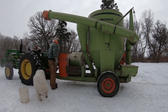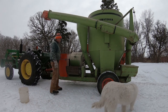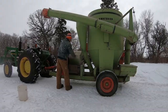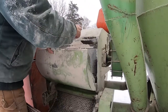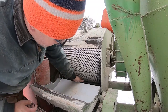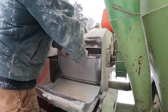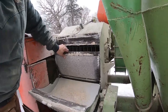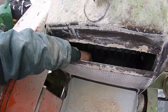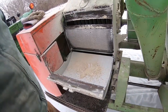The mill can be run either without the grinder running or with it grinding. There's a tiny push-in here to lock the grinder in. Essentially there is a screen that everything needs to get pushed through in order to be processed, and in there are the hammers that spin and knock against the screen real fast. That's how it hammers apart the wheat and the oats and everything into our final feed.